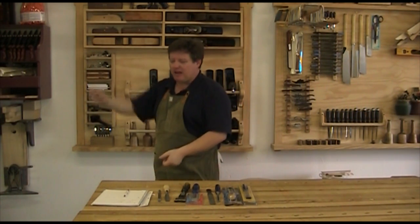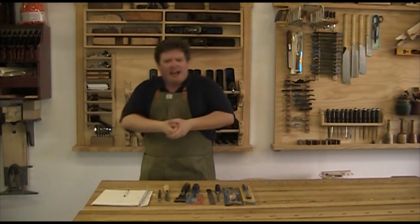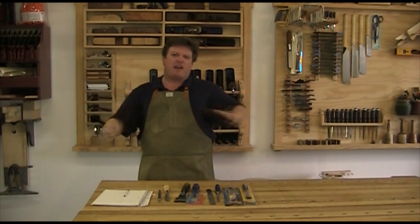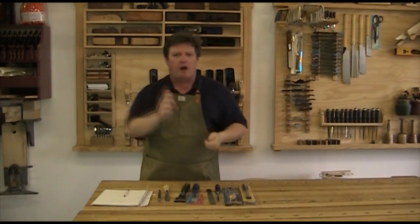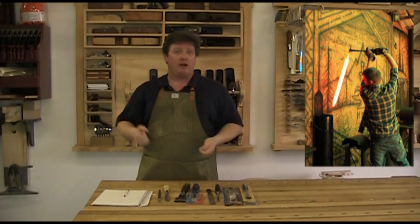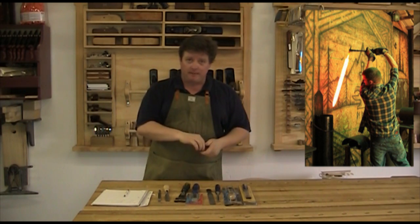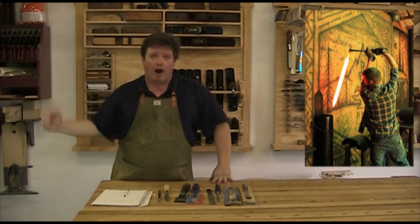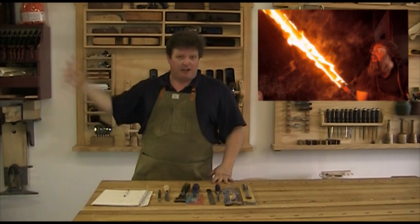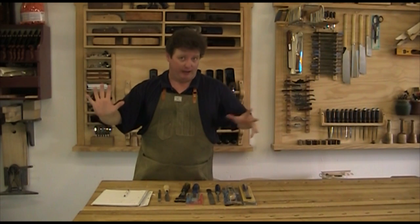Well, he bangs on it, he makes it the shape he wants, and then one of the last things he does, he sticks it back in the fire, and he shakes it around. He gets the air going in, fire's coming up. He gets it yellow hot, not red hot, yellow hot. And then what's he do? Well, because it's a movie, generally you see him take it over and dip it in a barrel of water. But in real life, a lot of those blacksmiths use oil, so you get a little fire coming up, which is why actors use water. Fire and actors don't mix.